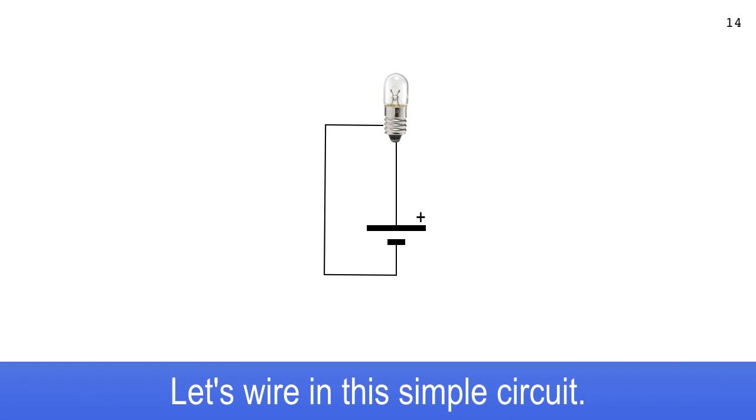Okay, now you guys notice that on my apparatus, the negative side of the battery is connected with my red wire, and that red wire connects over here to this part of the light bulb platform. That's what you want to measure, from the bottom end of the battery here to the other end of my red, and then get a voltage. Okay, and you got to give it a little bit of contact. And your connection has to be lighting up the bulb.